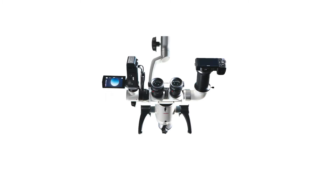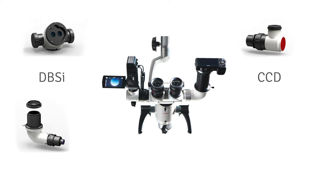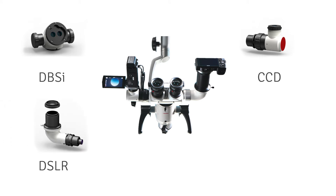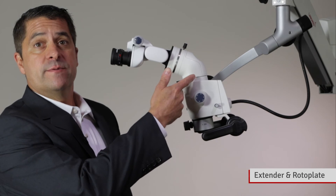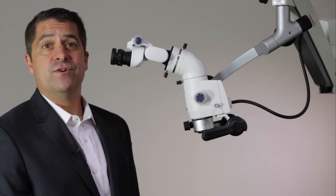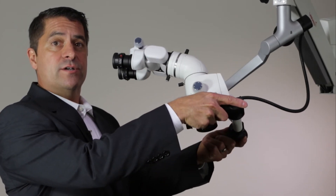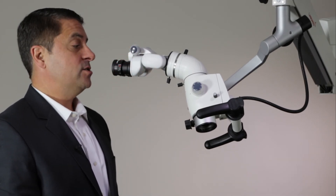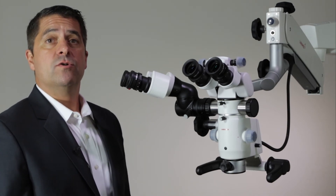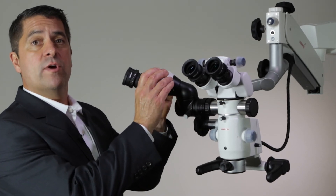The ProLine offers a series of video adapters and ergonomic accessories, including our incline double beam splitter, adapter for CCD cameras, DSLR adapters for Nikon, Canon, and Sony cameras, and our traditional flat double beam splitter. Our 45 degree extender provides a more comfortable viewing posture by bringing the viewing head closer to the viewer. The rotoplate accessory allows you to tilt the microscope up to 30 degrees in either direction while keeping the eyepieces aligned to the user, creating a more comfortable viewing posture. The assistant viewer bridge allows a second viewer to observe through the microscope, and can be positioned at various locations relative to the primary user.